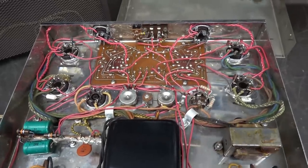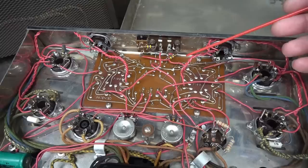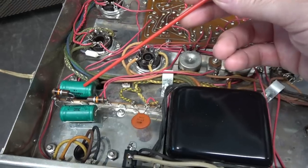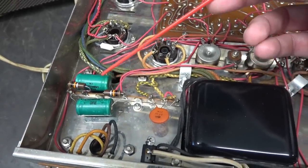Let's give her a look bottom side. The first thing is to look at the bottom of the circuit board — look for dark areas indicating overcurrent or bad connections. Over here you've got the negative bias caps, and those are obviously going to need to be replaced immediately.